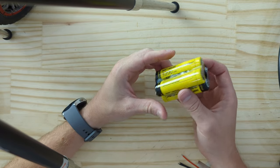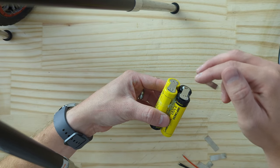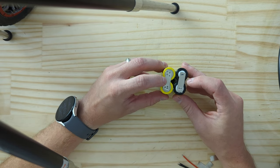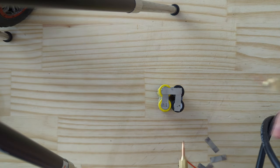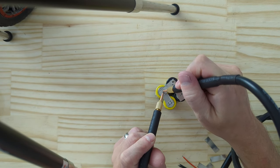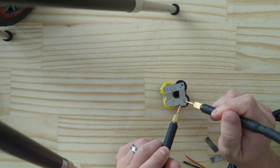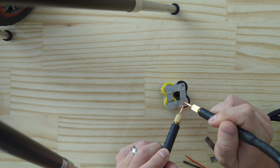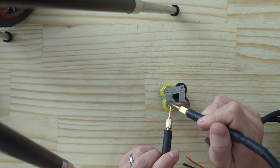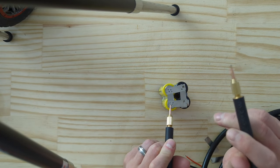Now I've got to pick a side to bridge these two together in series. I'll go from negative to positive — bridging over to this side, connecting to the negative and out. This will be the battery's positive end, so the negative and positive ends will be on the same side. The spot welder wasn't making a connection, so I turned the power up to 67 and that got through. There are now a total of four nickel strips there.